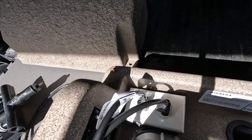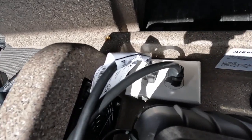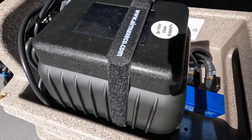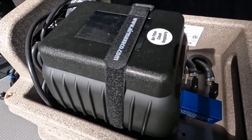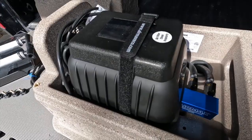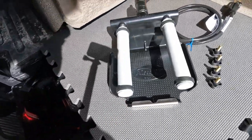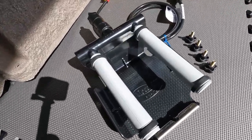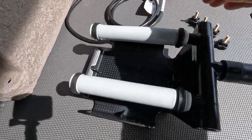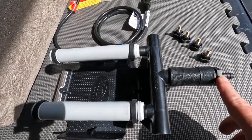It has a receptacle where you power the pump and the cooling fan. Getting back to the sound output, the cooling fan is probably a little louder than the compressor in operation, and so overall the system is extremely quiet. This SW20 will power up to two diffusers, and it uses a twin stick diffuser with a self-weighted base. It also has a built-in check valve, so it prevents any water from backing up through the lines and damaging the compressor.